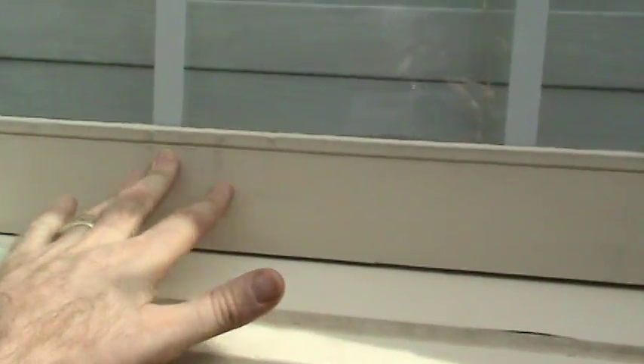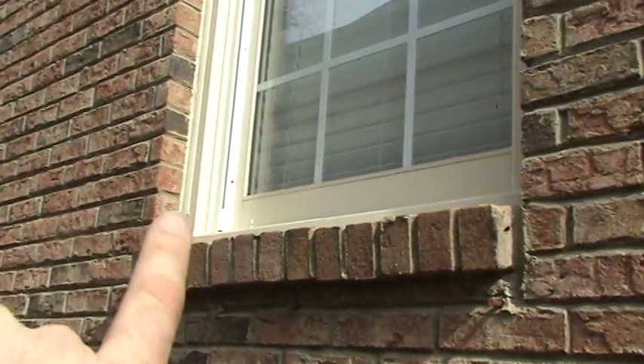On the left side of the house, we've got a little bit of rot. We're only able to do so much from the ground — when the boys come out we'll break out the ladders and go over the rest of the house. He's got a little bit of borer bee damage up here. On this left side face, it just needs to be skimmed and the paint touched up. This window right here — he's got a rotted sill board at the garage. You can see how spongy this is, so this one we can't piece in or repair. We're going to have to replace the whole sill. The sill is what the window sits on, and this nose is rotted as well on the corners — I can put my fingers right through. Same with the brick mold on the left and right sides, it needs to be pieced in on that first window. The left brick mold on the second window on the garage side is also rotted, and we'd probably guess there's some rot in this third window as well.